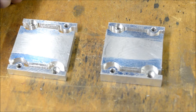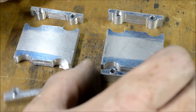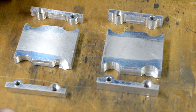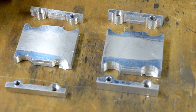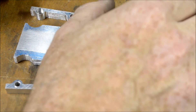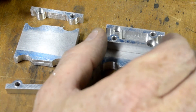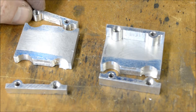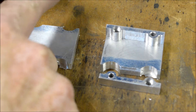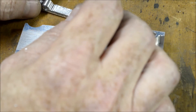This is what we've got now — these were the two pieces, and this is what we're left with. I could always mill this all flat and use this again — I could make some more stops out of that, possibly another four, maybe six — squeeze something in there. But for now, four is plenty. I'll clean this up and we've got to cut these in half, separate them, make them two, and clean them up so they're nice and symmetrical.